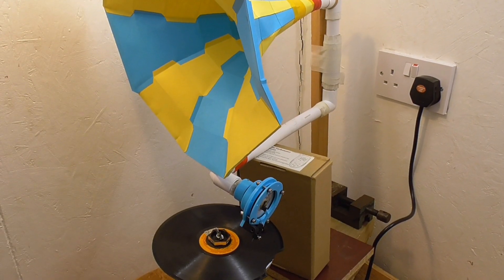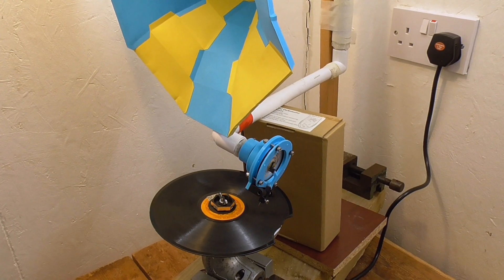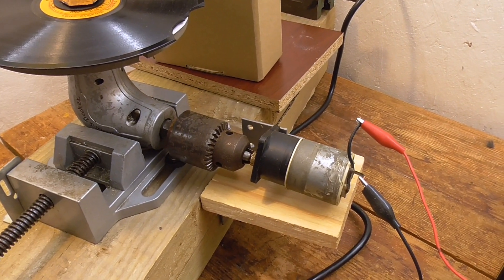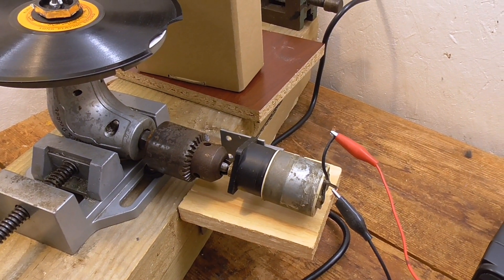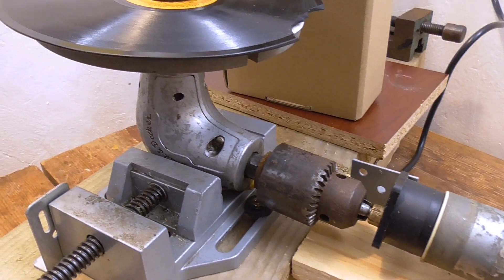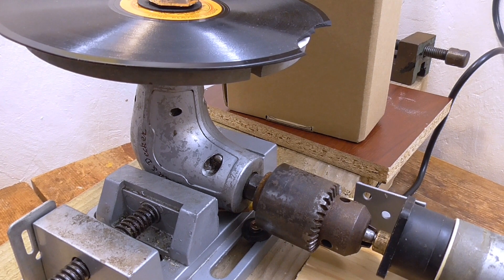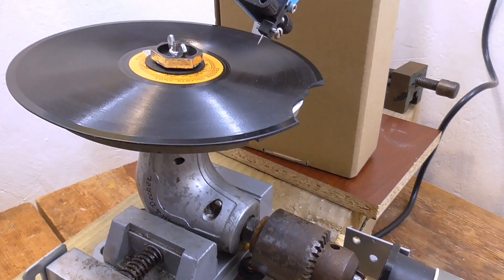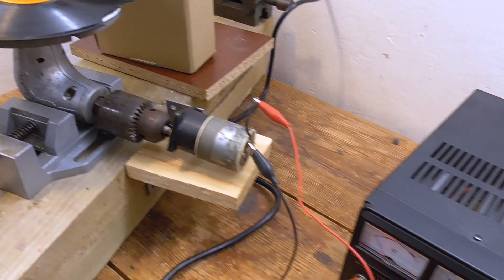Hello again, Mr RG Stuff here. Now I'm back in the workshop with this — well, it was a hand crank gramophone but I've slapped an electric motor on it. This is one of these geared ones I picked up recently that gears down to about 60 RPM, and I thought with the drill adapter in there, which turns a speed into about one and a half times the speed, I can probably get about 78 RPM out of this — and indeed I can.